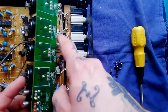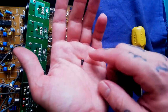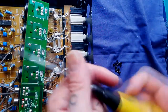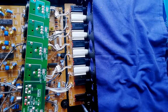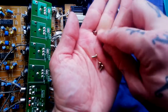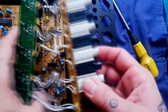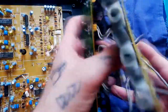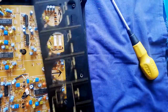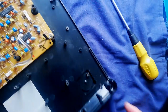There's a shared connector, so this won't come away from the board altogether. The screws are narrow ferrule black — it's the larger screwdriver needed to remove them. Then five more screws: wide ferrule, short screws there. This will now lift away to get underneath for any soldering needed. The back plate comes off, slotting out of recesses in the plastic case.